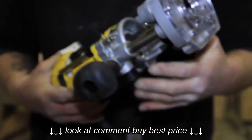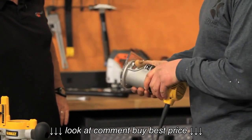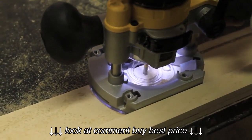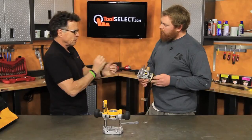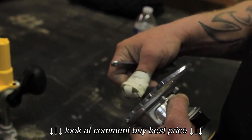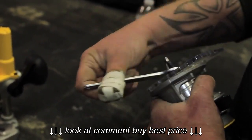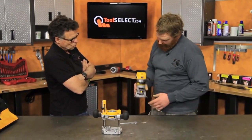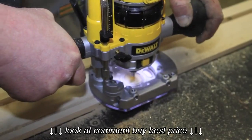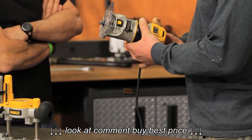There's a nice little lip around here that protects your fingers — almost like a stop for your finger so your hand knows where it's at. And it plowed through all the wood that you wanted it to. With any router, the router's only as good as the bit. If you have a dull bit, you're going to burn through anything. If you've got a good sharp bit, that's where the variable speed comes in nice. It comes with two LEDs so as you're routering, it lights up the surface so you can see if you're going too fast or too slow. With those lights you can also see the depth of your pieces to see if you're leaving any grooves that aren't supposed to be there. And if you are, it's got a little 1/64th adjuster.